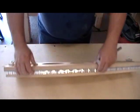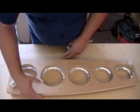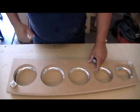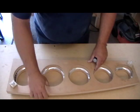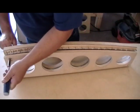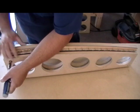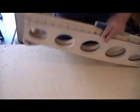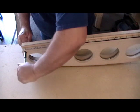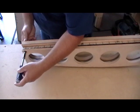The way this works is I kind of dual-purposed the form block. This was also a form I used to cut the actual rib blank, and I oversized these holes by three-quarters to give me the ability to center-locate the die. I repurposed some tools because I was running out of MDF and places to store everything. If I have to make another rib blank, I can always use a different set of external forms.